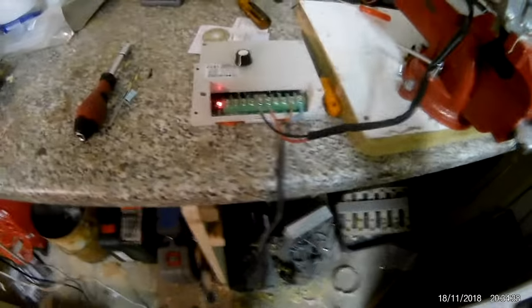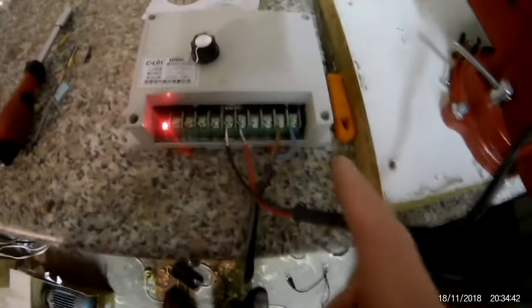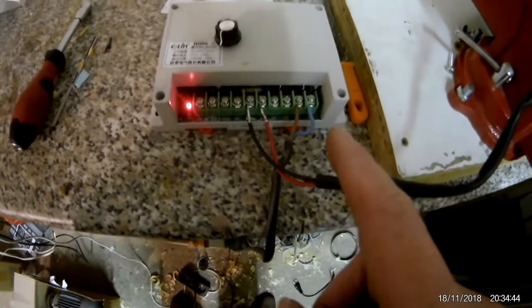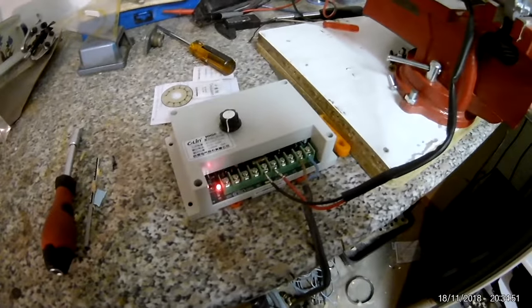You might remember this from a different video. So this thing is supposed to be a motor control. This has input, line, neutral. F2, F1 is for field windings. That is pure DC, I think. Let's see if we can measure that. So we get this thing out.